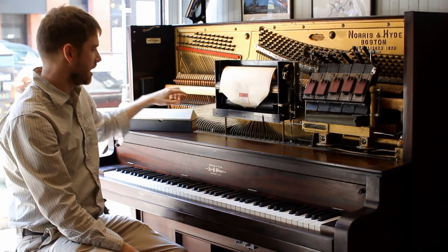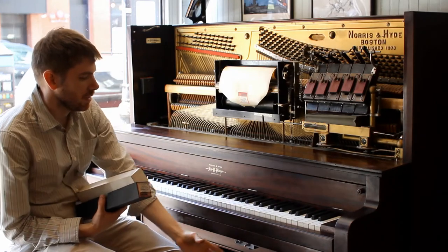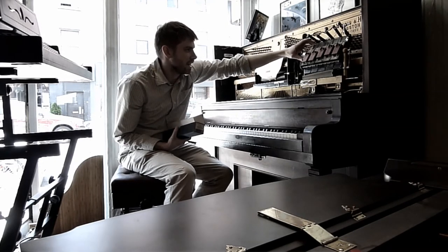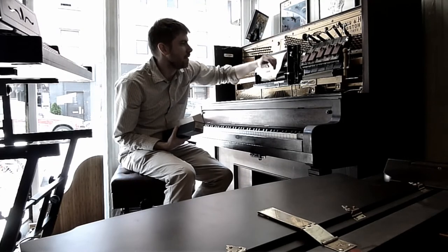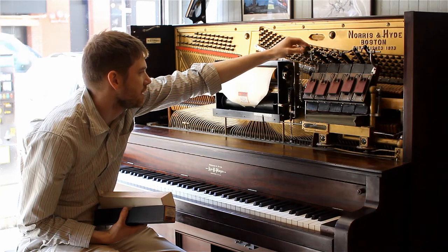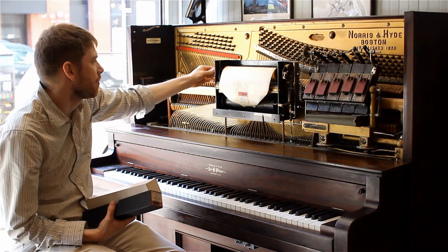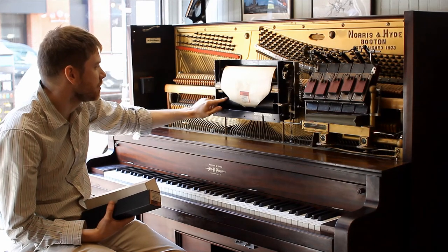Basically, I'm just about to turn it on, but when I turn it on, you'll see the air motor here. Air suction is created with the motor, and it creates this five-point motor system here, which will spin. As air comes in and out, it collapses these pneumatics and causes this cam to rotate, which in turn, it's a giant Rube Goldberg, actually. This drive chain is connected to a gear that works the spindle box that turns the main spindle, and then it's taken up here down below on the take-up spool.